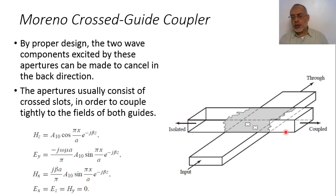Looking in the other direction, we have a phase shift of minus 90 degrees from the slot position plus 180 degrees from the odd symmetry, and an additional 90 degrees from propagation back to that point. This results in the magnetic fields being in phase in the forward direction, so they add together and introduce a coupling coefficient at the coupled port. The signal passes through to the through port with a sample of power going to the coupled port, while the fourth port is isolated.